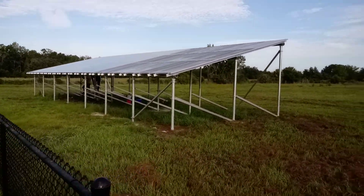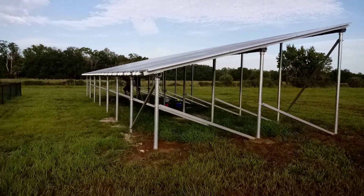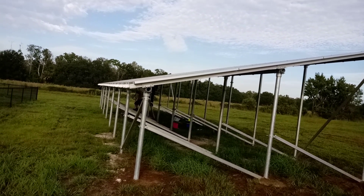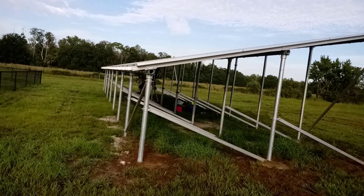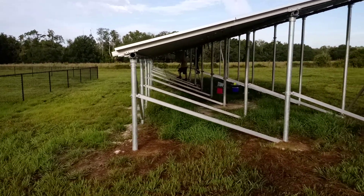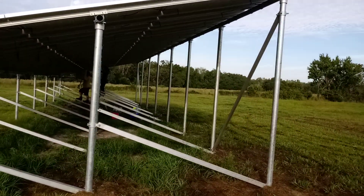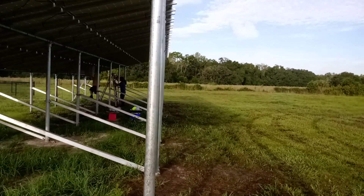The reason this array is so high is because they've got a 48-inch flood plain out here, so everything has to be mounted up pretty high. Even with that addition, it turned out flat as a sheet of glass. This is a 3-inch IronRidge pipe mount with plenty of bracing on it — we're in the 145 mile-per-hour wind zone down here.